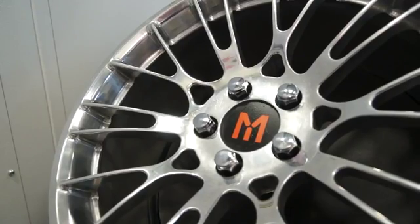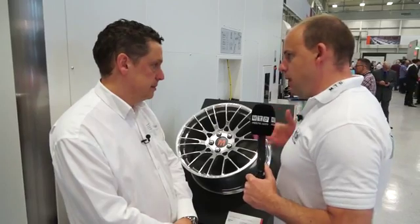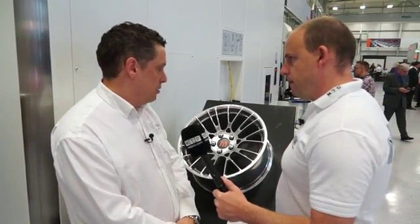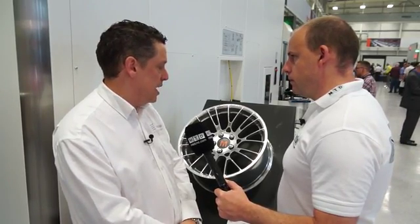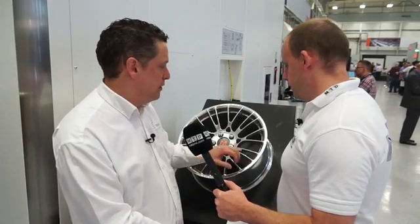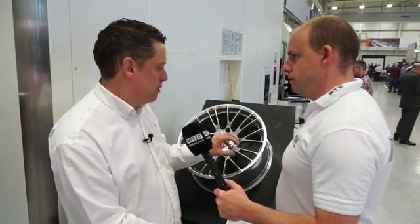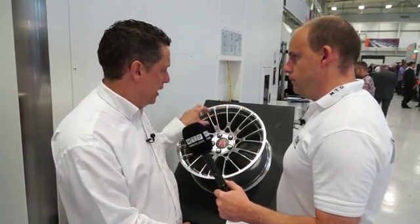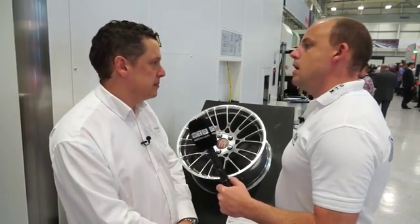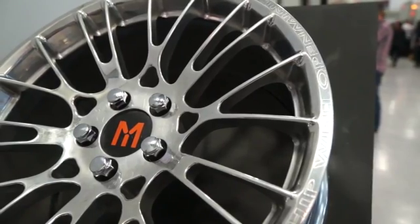Okay. So this is actually the part that's being machined, obviously an alloy wheel. Talk me through how you go about programming it. Oh, certainly. In this case, what you're looking for is features. In this part, there are 4 individual pockets arrayed around the part. If you focus on a particular pocket, you're able to get the benefits of our array feature and get the other pockets for free. How long would it take you to program something like this from start to finish? Certainly less than a day, this is possible.